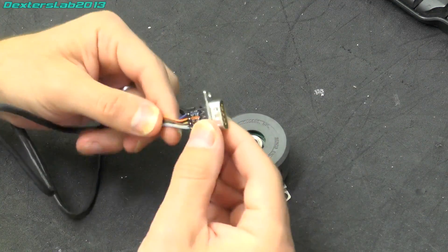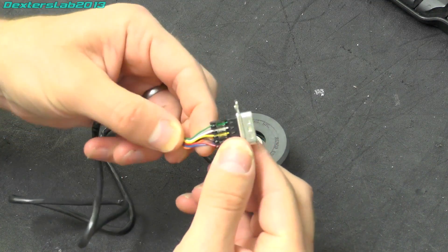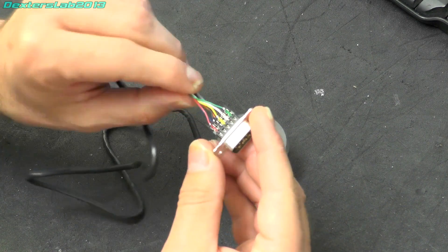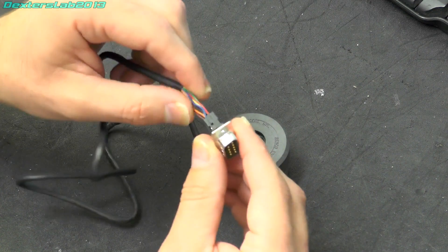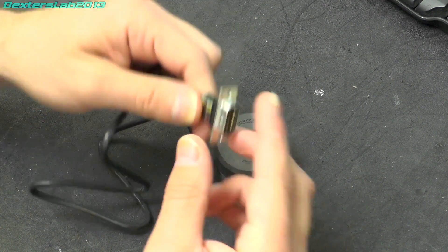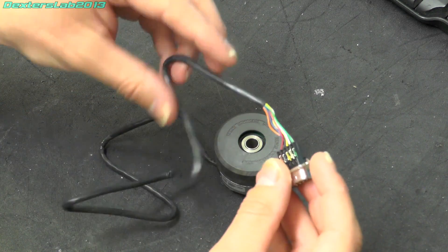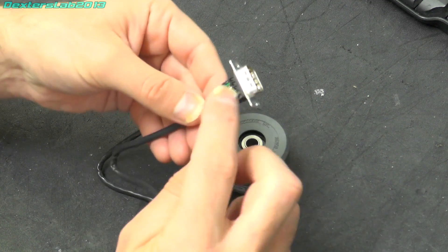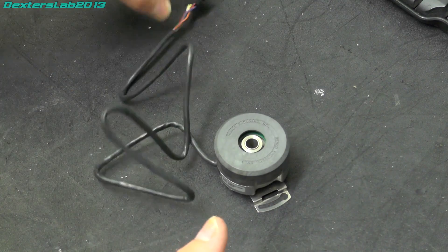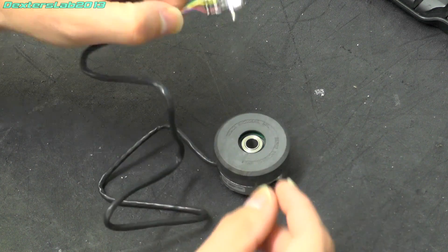The connection is lots of wires. We've got a nine-pin D connector here and every single pin is connected to something. So obviously there's probably power, ground, and then all the signals coming back out. That would plug into whatever you're using to sense it. It's not RS232 or anything, but I believe the connections are differential, which probably explains why there are so many wires on it.